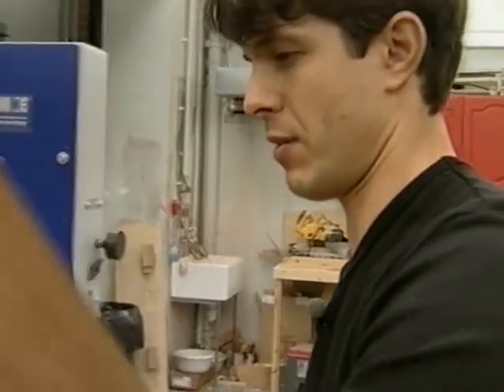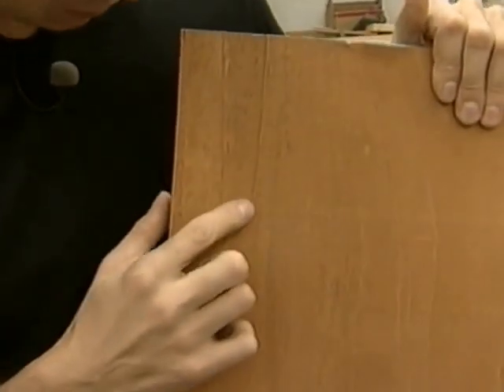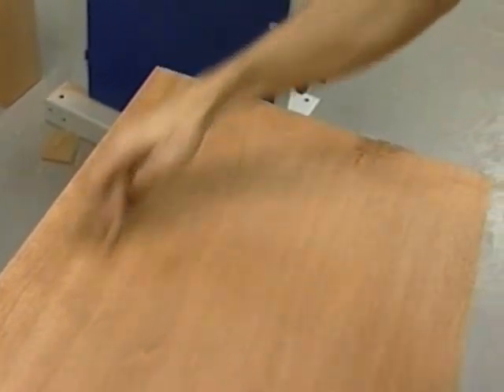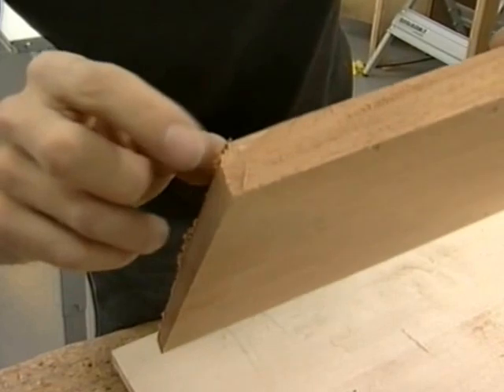There she is. I don't know what the best side is. Dennis always says to keep bow up, so she is reasonably flat, this piece. Looking at defects — got a little bit of a split running down there, running all the way through. This is the end of the board until it's painted, and it runs to about there. Now we can lose that because we're going to end up ripping through there anyway. The router creates a terrific decorative edge, but there's always a danger of the wood splitting. There's my first end done. You see what I mean about the breakout there, but we don't have to worry because we will take that out and we run with the grain.